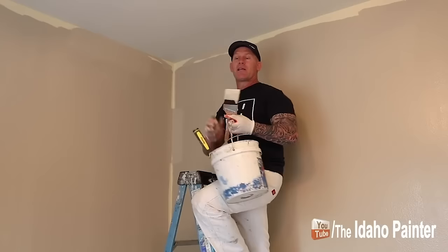I like my paint to go up onto the ceiling very slightly versus staying down on the wall only. Because it goes up onto the ceiling a little bit, it will always look straighter than if it's below the ceiling — you'll see a crooked line a lot better if it's below. So I'm always siding toward getting my paint onto the ceiling versus keeping it down on the wall. For one last demonstration: dip my brush, pat it on the sides to make sure it's loaded up, carry it to the cut-in area, get it about an inch from the cut-in, work up to it, and glide it right along the ceiling about a foot before it starts to run out of paint.